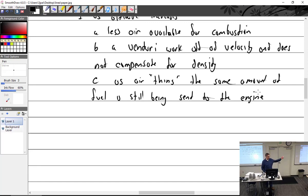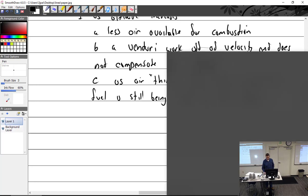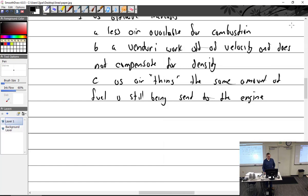So, right, I take an airplane out there right now. Our density altitude is, what are we at temperature-wise? Let's see, I got 43 on my watch. So is that more or less than standard day? Less. Colder than standard day. So probably our density altitude is less than 75 feet. So what's that? We're underground. We're in Death Valley. So, all right, let's just say we do a power run-up on the engine out there, and it's 10 gallons per hour. And oh, it's going to be a lot of power. It's going to be a good day.